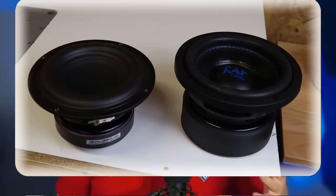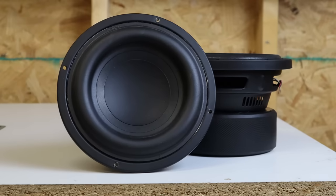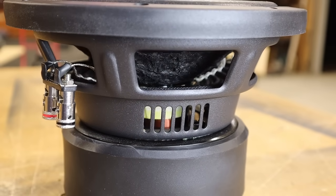Like anything else in life, there is of course a drawback to this. High-power subwoofers typically need stiffer suspensions, and stiffer suspensions means a higher FS. So when Savard designed this sub, they had to figure out the best way to balance those trade-offs. Keep watching and we'll find out if they managed to pull that off.